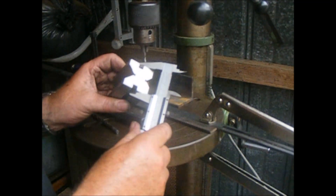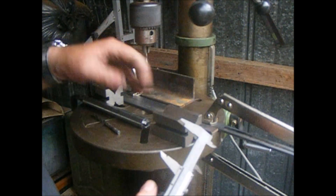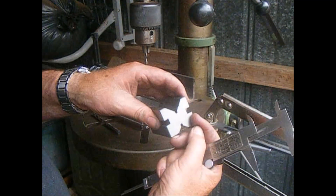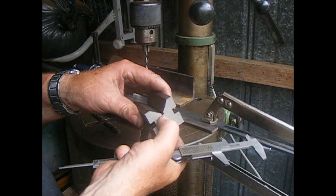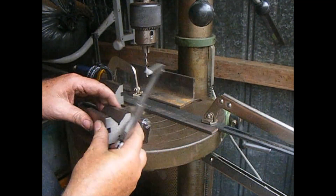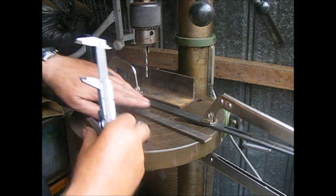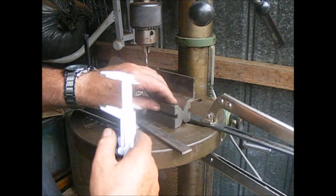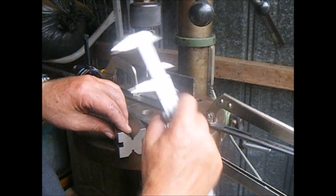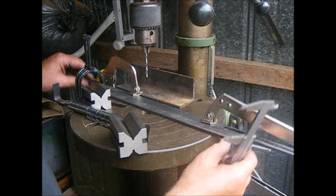The exact overall width of that is 44mm wide, so from the centre of the block to the edge — which is nicely machined for setting out — is exactly 22mm. So how do we get from 22mm? We want to set up a little sliding rail here, makes life a lot easier. So how do we get that exactly 22mm from the centre line of the drill bit, which is the reference?